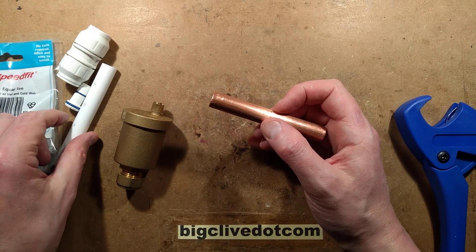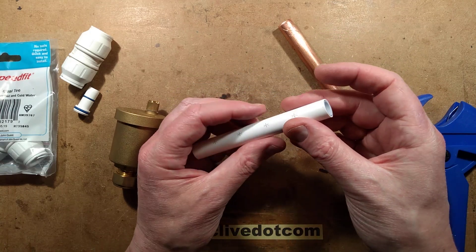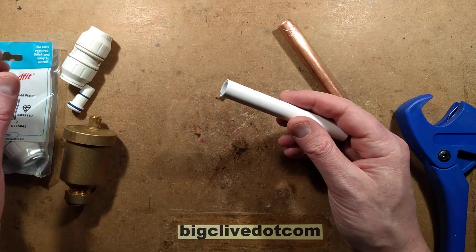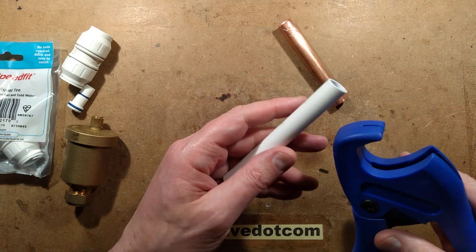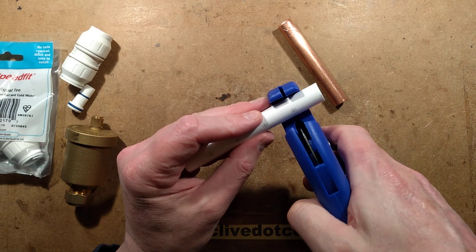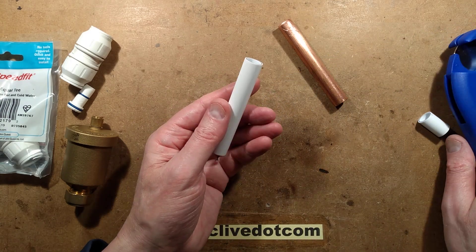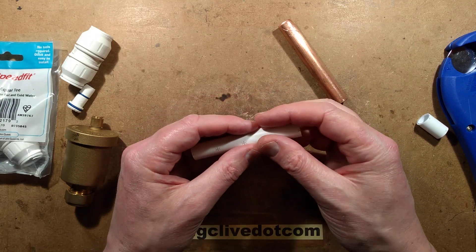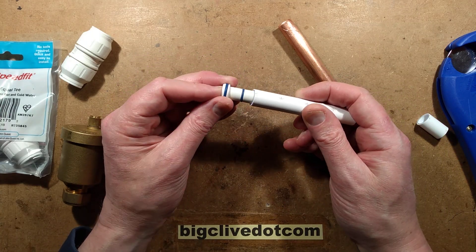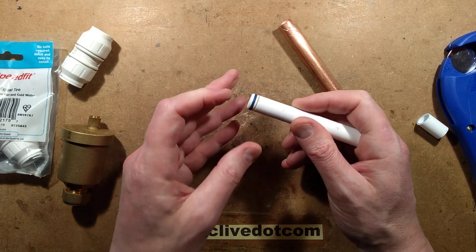I decided it was time to replace the pipework — it's not going to be that complicated. Since everybody was recommending plastic, I went for plastic. One of the nice things about plastic is that it's very easy to cut. This uses a compression system — to terminate it you get your pipe, cut it to length. There are marks on the pipe that are really just a guide: if you cut on one of those marks with a standard pipe slicer, the spacing to the next mark shows how much it has to go into the fitting. You also have to put an insert inside to support the plastic pipe — that's a common early cause of failures of this system.